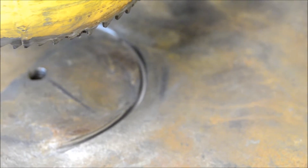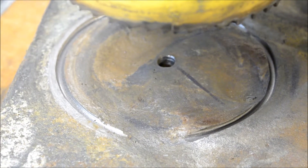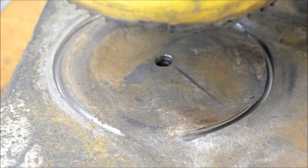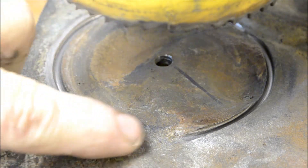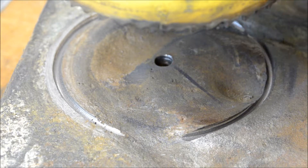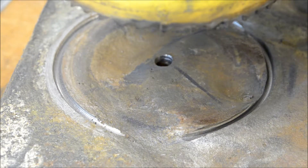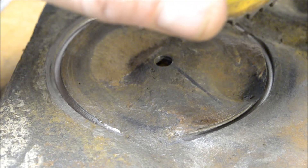This is about 40 minutes into the cut. It is a slow go. I'm still not making a continuous cut all around. This is probably almost halfway around — almost 180 degrees. There's still a spot we haven't touched yet and two little pieces back here. These are the two deepest parts and we're still not through. The hole saw's been holding up good. I still have the wet paper towels underneath here, and that seems to be a great idea.